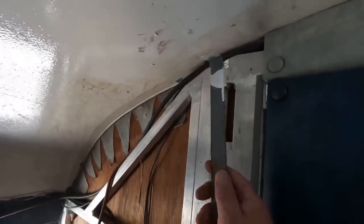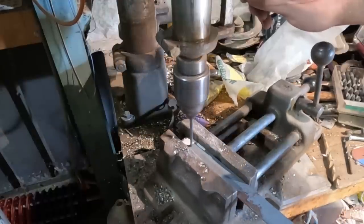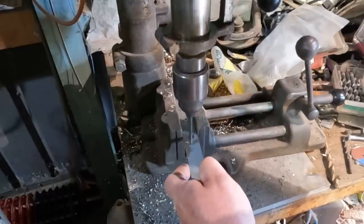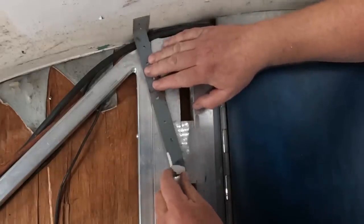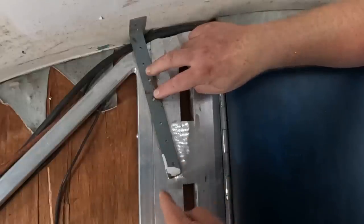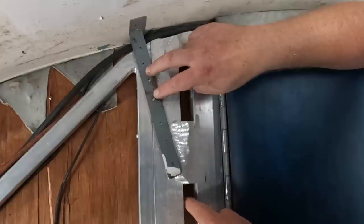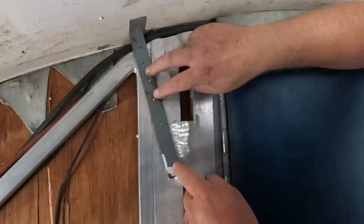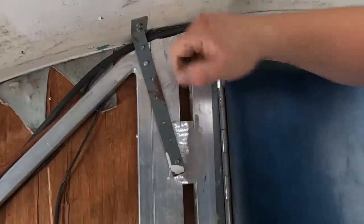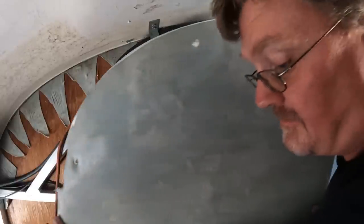I lost my attachment point that wasn't attaching very well anyway, so I'm going to repurpose one of the shelf brackets. I don't actually know where I want my holes, so I'm just going to make a selection to choose from. You don't want to go into a wall because that won't drill right. You don't really want to go in the center because it's not as strong — it's actually stronger near the edge where it meets the next wall on the tubing. So if you can go slightly off-center, you're in better shape. It's nice and sturdy now, better than it was before. This bracket holds those wires in place so they can't fall out. Now this panel can go back on.